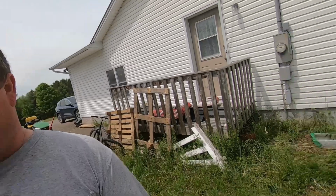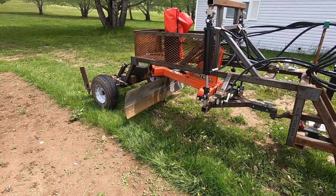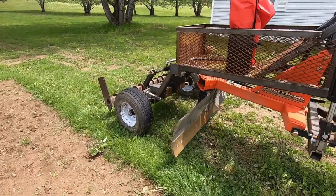And so the biggest reason why I built this is last year I did a section of trail at about 3 kilometers with the box blade, and the box blade comes out about 6 inches past the tire, and it's not quite enough for the trail. There's a lot of dirt that has been moved to the outside of the trail, and this thing here with the ability to dog walk the trailer to the right side of the tractor keeps me on the trail, puts all the rugged metal and stuff into the bushes so I don't have to worry about it, and I can bring that dirt back in. And the fact that it actually is like a grader, it will smoothen out better. I had a lot of whoopie-doos throughout the trail after I did it with the box blade.